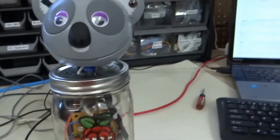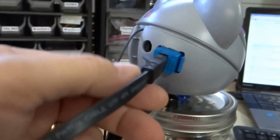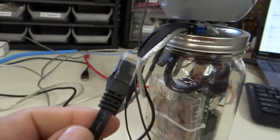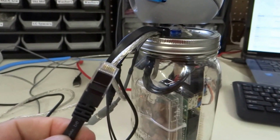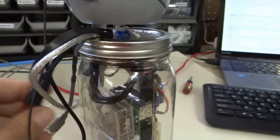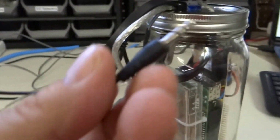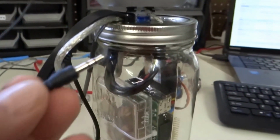So we're going to turn the power off, and if you look in the back, you can see this basically is an Ethernet cable that I used because it's got handy dandy twisted pair all the way through. This delivers power to the robot, as well as I2C signals for the sensor and the LED. Didn't have enough wires, and I wasn't too eager on running the audio through, so this is the original powered speaker head audio plug.